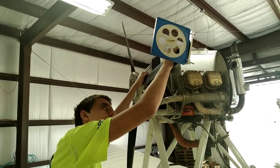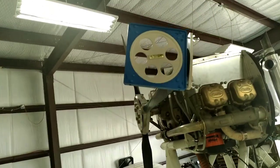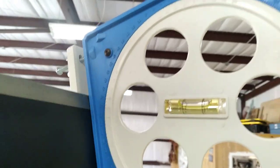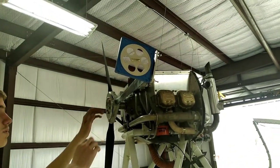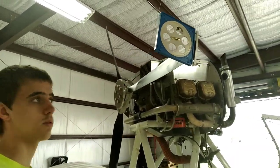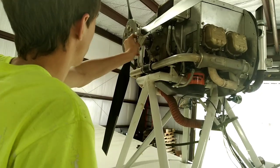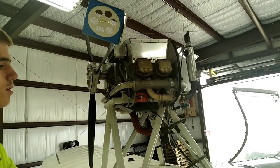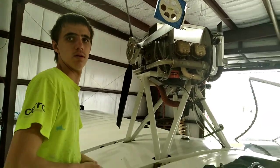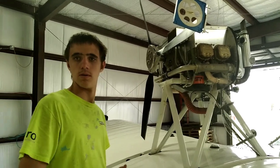That's going to be a little aggravating, isn't it, Charlie? You got it pretty close — I'd let that ride and see what it looks like. You've got a little tiny bit more tweak in there, but that's the gist of it. Charlie, what's the next thing you're going to do once you get that leveled up perfect? What I'm going to do is tighten up these bolts over here. Right, but we're not going to do it quite yet — we want to make sure that's absolutely perfect. Then we're going to go around and do it again, check it, torque everything down, and check it again. And then? Job done.